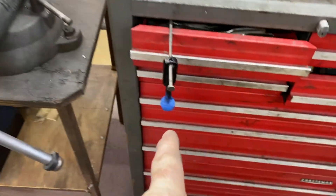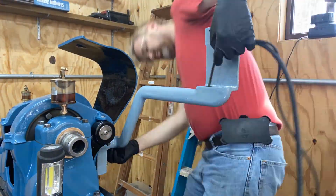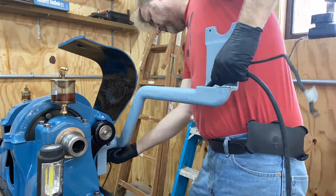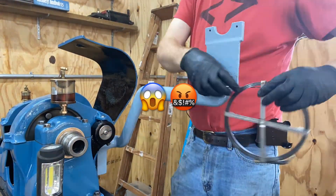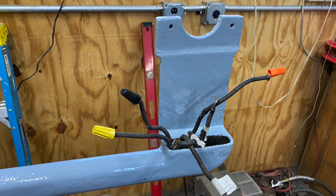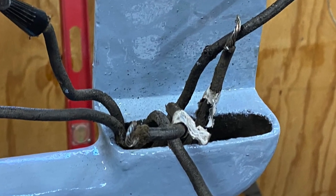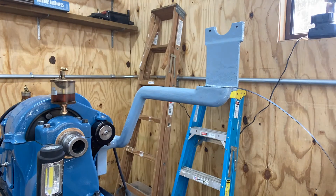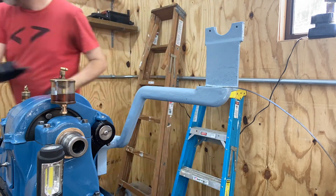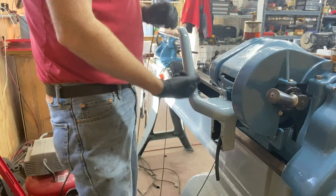The front plate got painted blue, and there's the handle. Now, as I was looking at this I found that several of my labels had fallen off and I was going to have to start from scratch. The wires in there looked really old — the old kind with a fabric wrapping around them — so I decided I want new wiring. I'm going to pull out the old stuff and see if I can run new 12-gauge electrical wires up inside that arm.